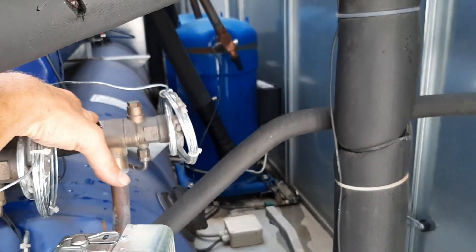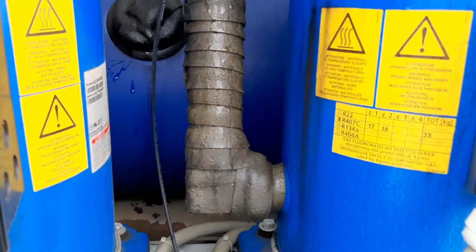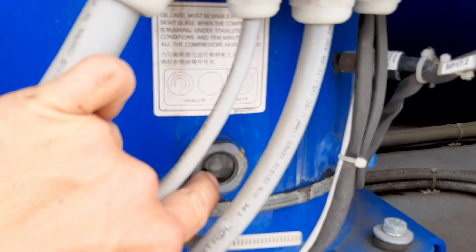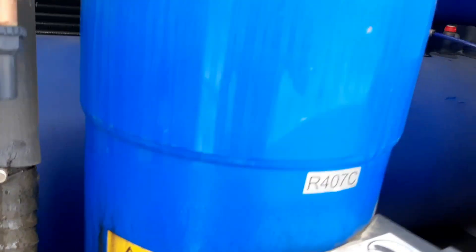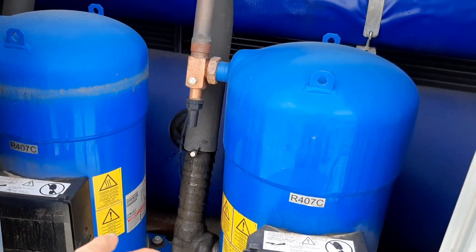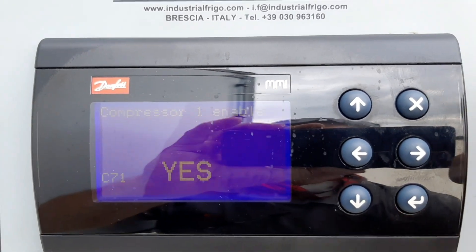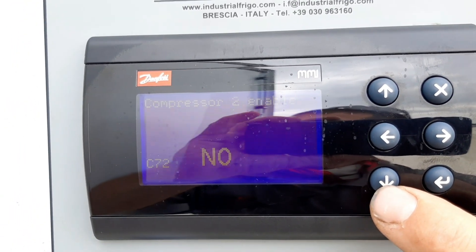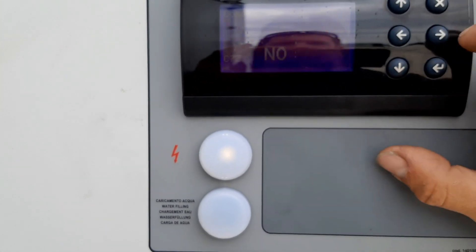See if that'll be enough — this one isn't doing very well anyway. It runs but you do have pressure issues. Some of them lost some oil. There's a leak on that coil of mine. We have 35 kilograms of refrigerant, so still investigating. We found a simple enable/disable screen — compressor one is still enabled and compressor two is now disabled. Compressor one just started back up and you can hear the fans ramp up pretty quick because it's got refrigerant in it. We're going to leave it like that for right now.